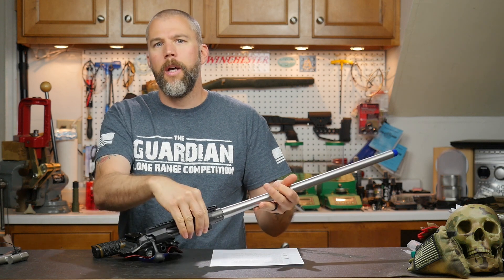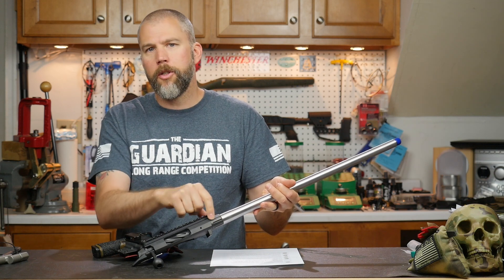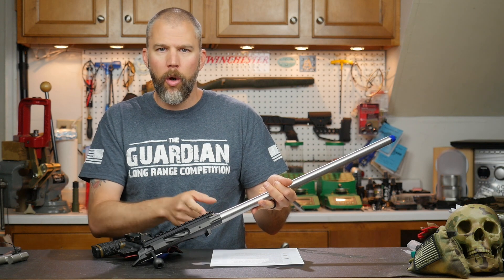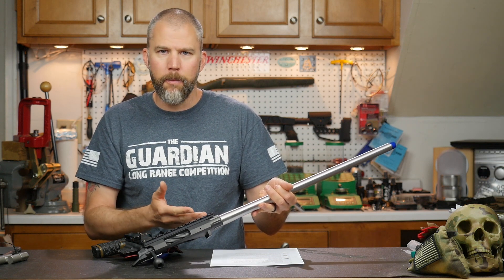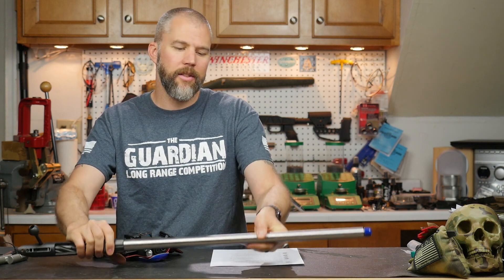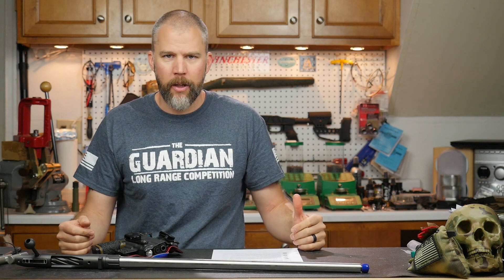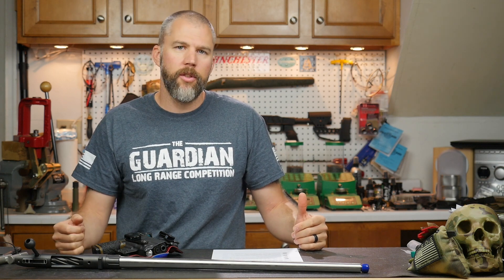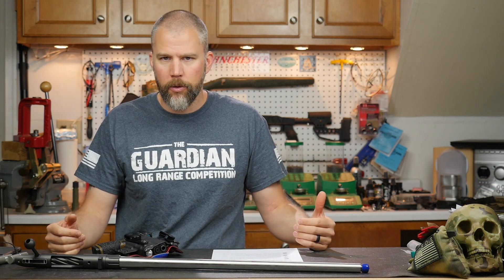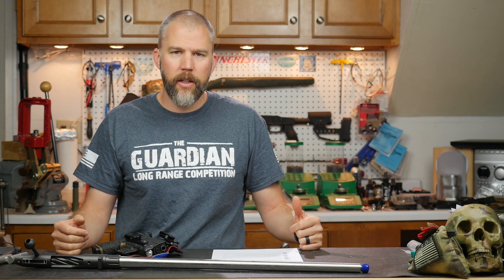Also, like on our Deadline here, we have this top rail — you want to make sure that that rail is going to clear a barrel nut. If it's too low or too closely contoured to the barrel, then you may have problems with that. And finally, you're also going to want to take that into consideration when you look at what chassis system you're going to put your barrel and action into. Some chassis systems may cause problems with that. Some stocks may need to be inletted for the barrel or for the barrel nut.